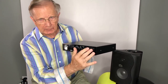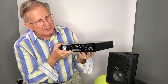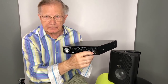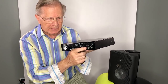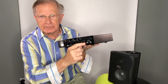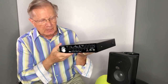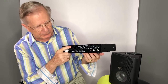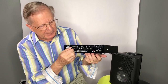This also has two headphone amplifiers — they're not just a Y-cord. There are two separate amplifiers, so the operator and the logger can both be connected at the same time, and they do get the equalization. Plugging in the phones does not disconnect the speaker. I also put a line out for recording, which is very important. I heard from one person where they did a field day and came out of the line out into a guitar amp so the public could hear what was going on with the receiver. We have a wonderful little meter, and most importantly there's an LED overload indicator. You have an input control — if you see that blinking, back down just a little bit.